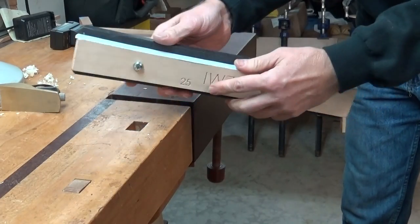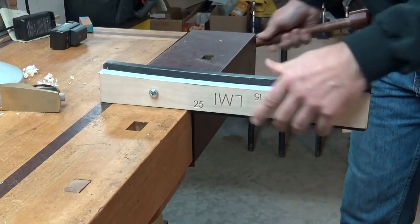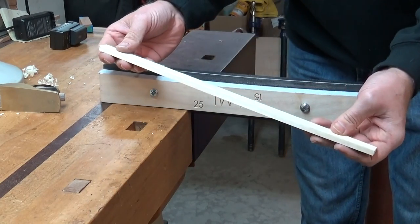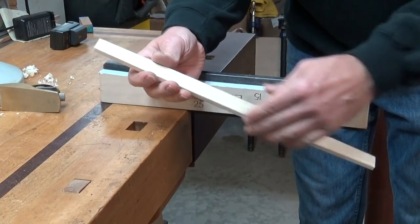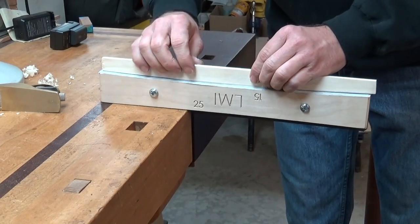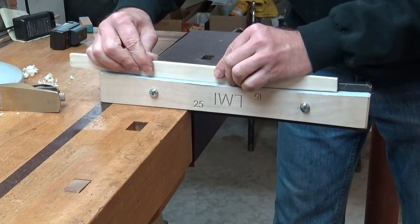Next, I'm going to take my brace sander and put it in my bench vise and clamp it. The radius I'm going to put on the brace is facing up and I have my sandpaper installed. I'm going to take my brace that I've pre-trimmed or pre-planed closer to that line I drew, place it on the jig, press it against the HDPE base — that's once again just a fancy word for hard plastic — and then move it back and forth.